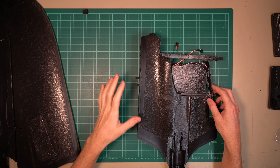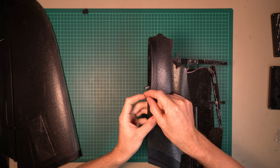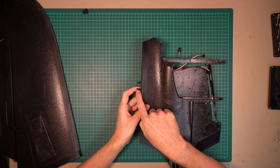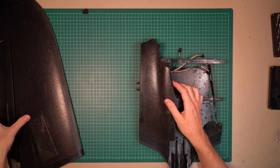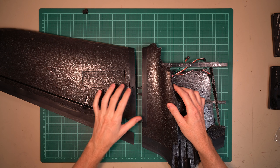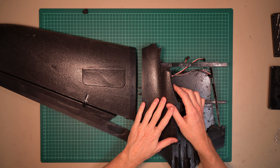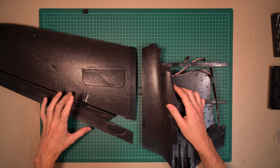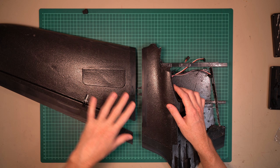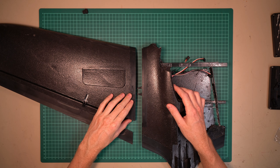What is actually holding your wing on is really this 1.5mm of plastic. Especially in the beginning, I had a lot of crashes when launching this wing. What happened is that these small plastic lips become worn and broken — and that's hard to see. In the next flight, due to vibration and g-forces, the wing slid outwards and disconnected from the aircraft. Without control of one wing, the aircraft has no elevator authority, only roll coupled with pitch — and that is why I crashed the first time into the forest.